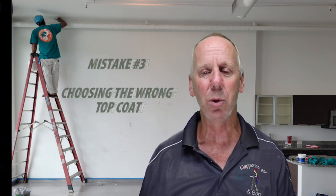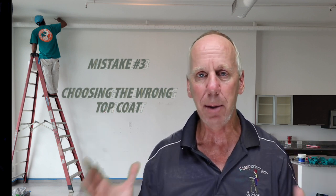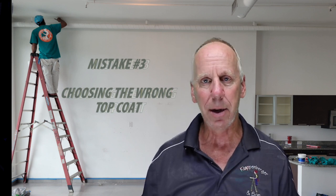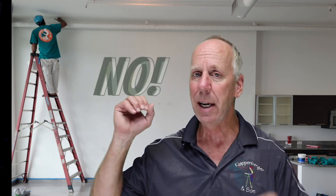Now I have videos on the best kitchen cabinet paint, but what I don't want you to do is just use any premium grade paint. Yes, they self-level pretty good. Yes, they're pretty durable, but can they withstand the oils that get transferred from your itty bitty fingers onto the top of the paint? They're going to soak through the layers of paint, and they are going to scratch off in between the top coats and the shellac primer.